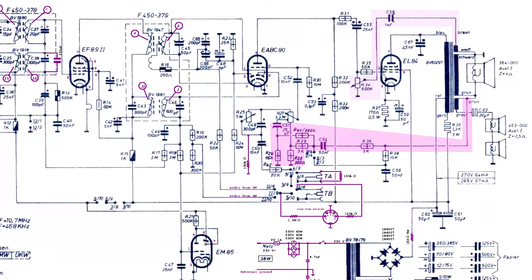On the lower side, there is what seems to be a more general purpose audio negative feedback, with the exception that if an AM band is selected, then the treble component of the feedback is not subtracted, sending it to ground instead. Which means that for the AM bands, the audio frequency section compensates for the narrow bandwidth with more treble tones.